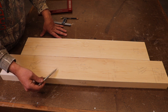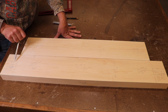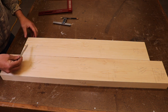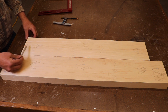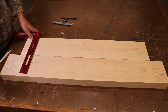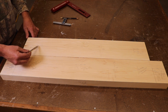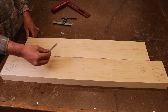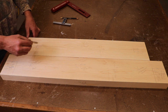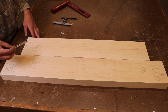Where I changed things: on the back board I wanted a little extra foot on each side, so I added two inches to that board. To get the hole locations, I registered from the front at three and a half inches in per the plan, then used a square to pick up that location on both boards — same on both ends. Per the plan, the front one gets an elongated hole so it doesn't bind: we drill a three-quarter through hole and then elongate it to roughly 15/16, adding about an eighth on each side of the hole.